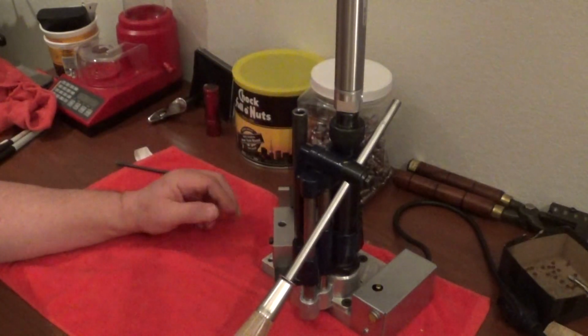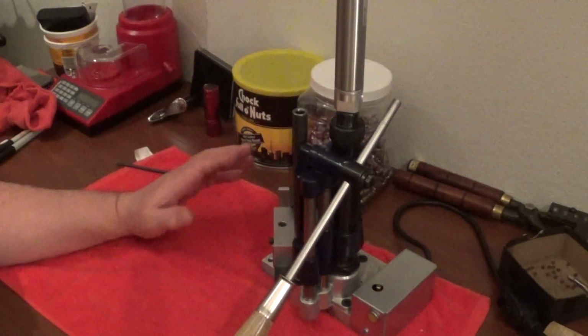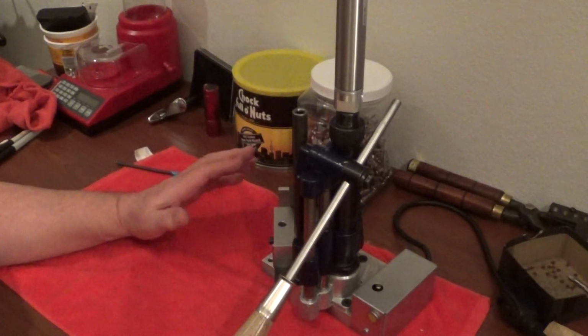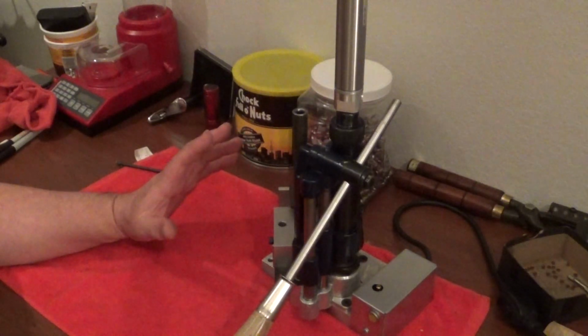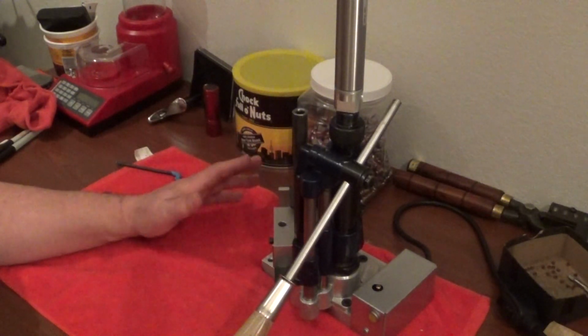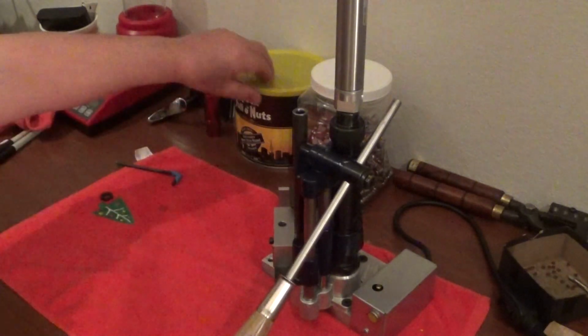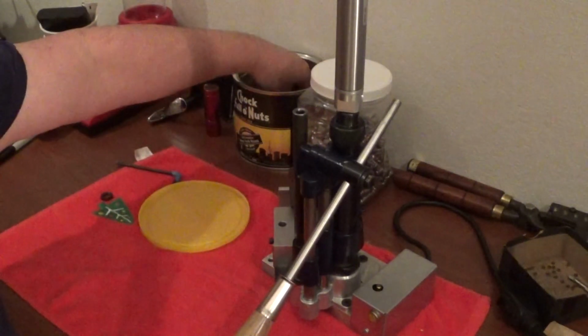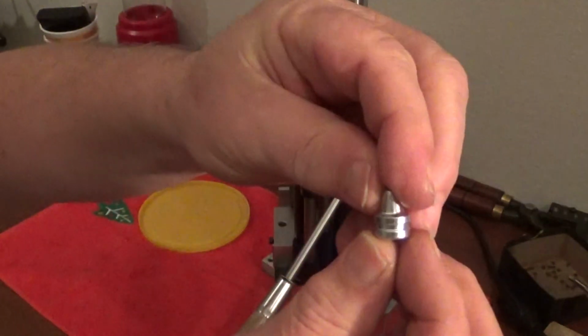That's why heat control is so important to casting, and keeping your heat consistent. You have consistent heat, you have consistent flow, you have consistency in filling of your molds, and then the consistency shows up in the weight of the bullet. So, matter of fact, I got a whole bunch of these still need to go through the lube sizer down there in the garage.